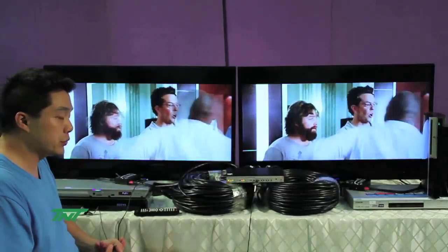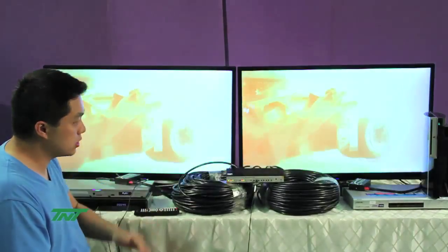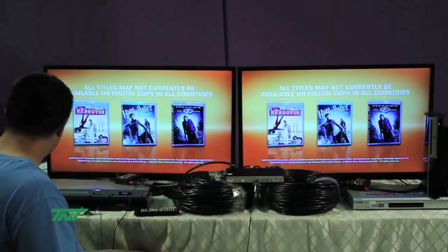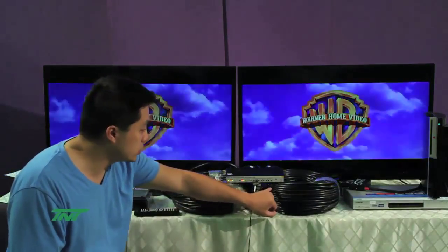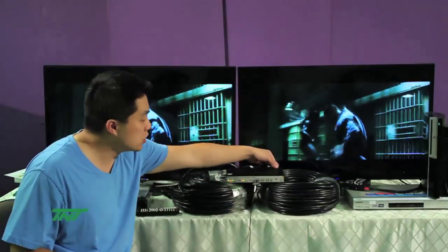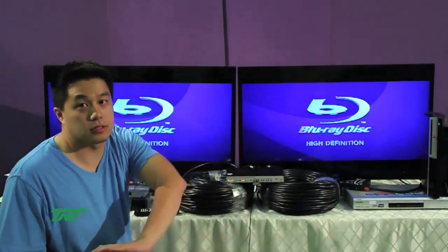Let's say I want to switch it. We have three different ways of switching. One is using the RS-232, which I haven't plugged in because I don't have the equipment for that right now. Then we have the remote control. For the remote control, the IR sensor — we have two different versions, two ports. One is for the front, in case you're using it right here. However, we also have the IR port in the back, which allows you to extend the IR sensor somewhere else in case you need it.